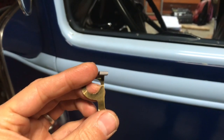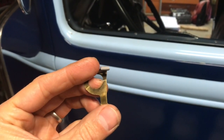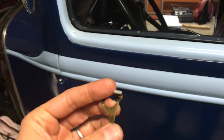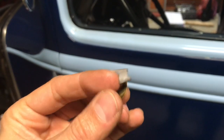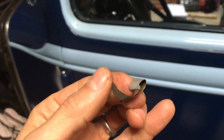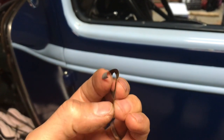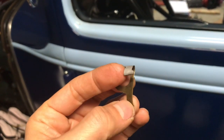So if you have to adjust your clearance, you have shims. Keep them marked on each side — they're layered. This is what one of the layers looks like. You have to measure it, but most of them come in three thousandths.